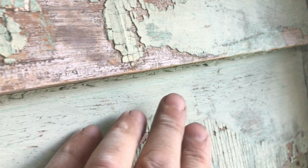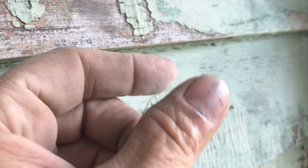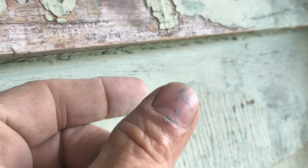And the way the house is built, you have the studs and then you have 1 inch board, 1 inch of board, and then you have the siding. So by angling it down, you're going into that 1 inch a long ways. And then I nailed it tight. I didn't overdo it. And then I did the same thing over here.